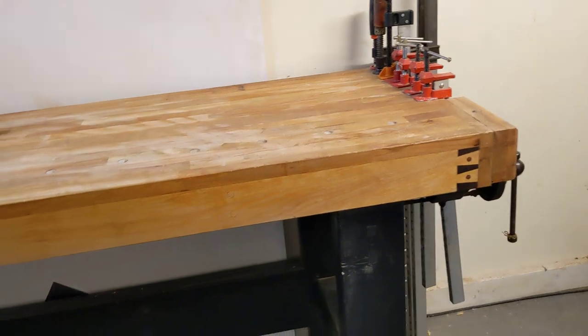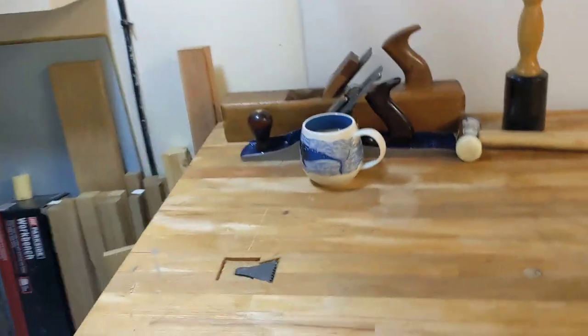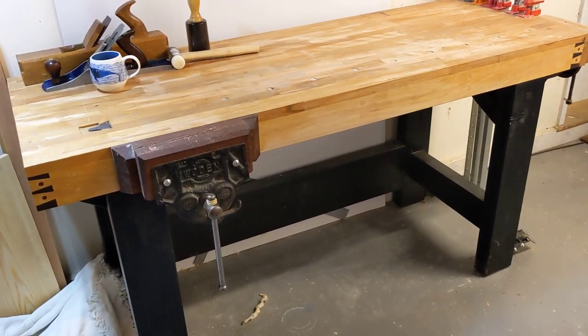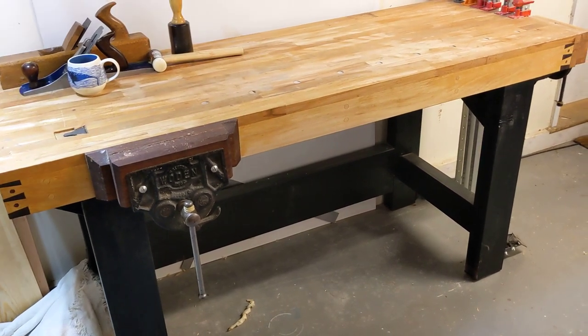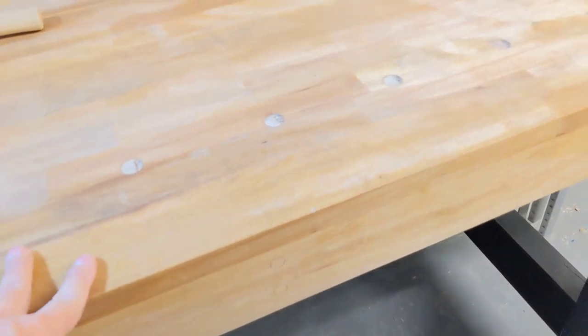Now the bench top — I don't know that many other people would go for this, but the reason I came up with this design was just materials I had to hand. What it's made of — I can't really see underneath because I painted it black — but it's two fire door blanks, or off cuts of fire door blanks. You can buy the material in eight by four sheets and internally it's like a big heavy-duty plywood — not the ones with a chipboard core, but kind of three layers of about 11mm staves running across each other with a plywood facing. So they were just off cuts. I used a full-size piece for the underside and cut it the same width as one of those butcher block type worktops — that's just one I bought off eBay.